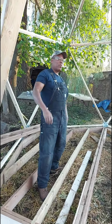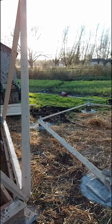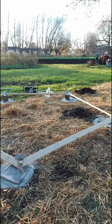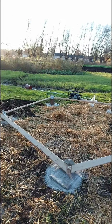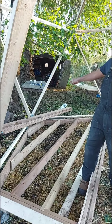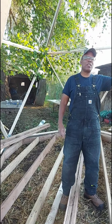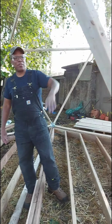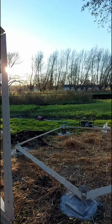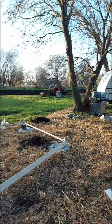But before we did that, we had to make a base, like the base you see over there, which we used a laser to get a basic elevation. And we went off that corner over here behind the 2x6s. And so this structure and this structure will all be the same height, as well as the third structure. So these are for storage and whatever the client wants them to be.